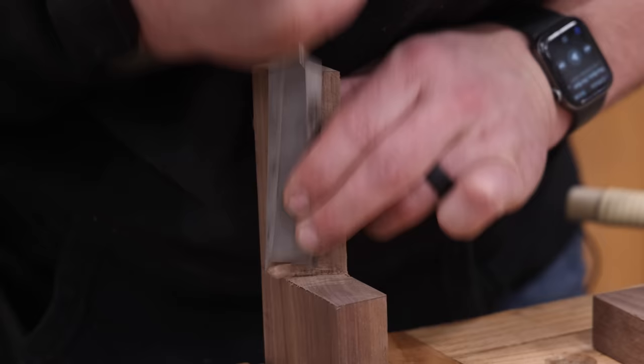Now that all these parts are roughed out, everything's shaped and fits together — time for a glue-up. The last thing I need to do with my base before sanding and finishing is round over that top edge. My base parts are dry so now I'm going to run the template on them to clean everything up, hit it with a round-over, then glue it all back together so it's actually a base. Then we'll get to working on the drawer box.